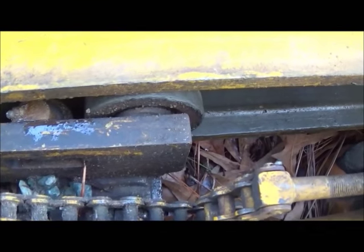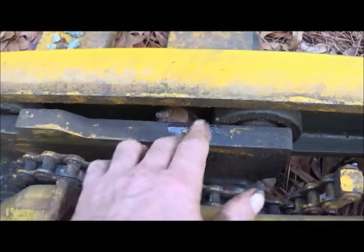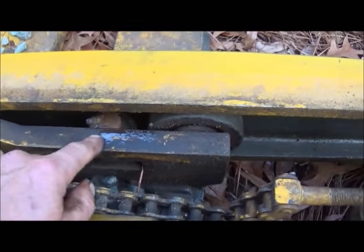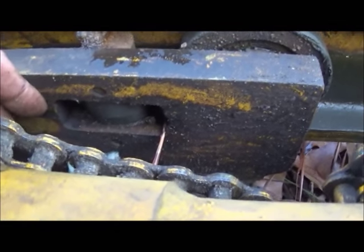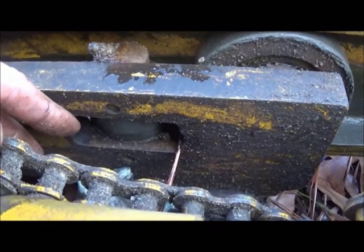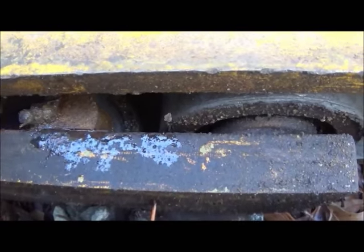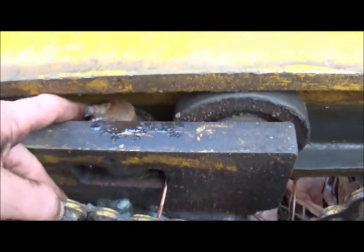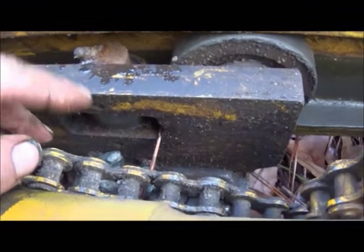Okay, folks, you can see how this trolley is made. This is in 1 inch, just like what we're using. And this is basically the same setup, except we're going to use four rollers. But you can see they actually slotted it. It looks like it's probably 1 inch tall, maybe 2 inches long, maybe 2 1/4 or something like that. And they've got it on a pin, with one side of the pin surface flat, and that would be the way to adjust it to the side. And then they've got it bolted on.